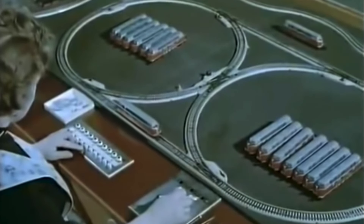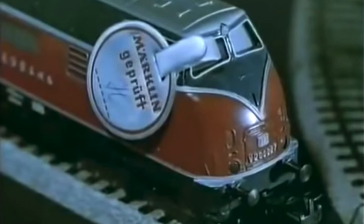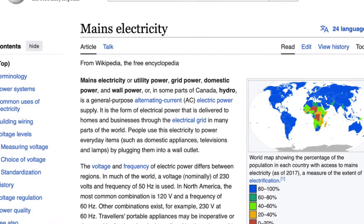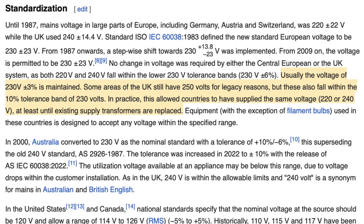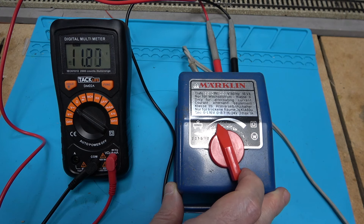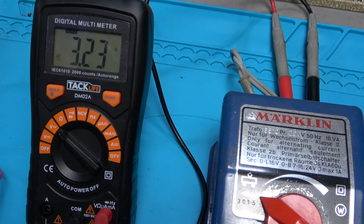Until the mid to late 1960s, differences in voltages and quality of the electrical grid were relatively commonplace and could impact the output of a transformer, as it is proportional to its input. Over time these differences evened out, but the voltage increased, going up from 220V to 230V plus or minus a few percent in Europe. The UK ran and still runs at 240V. Märklin transformers designed for 220V — those with a metal casing or a blue plastic casing — will have a higher output today as a result, hence the occasional need for an adjustment.